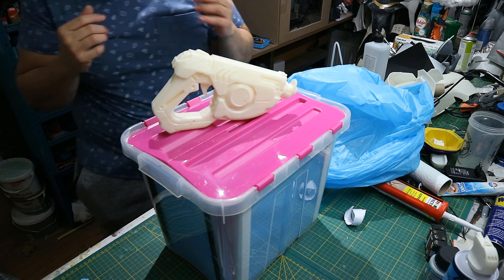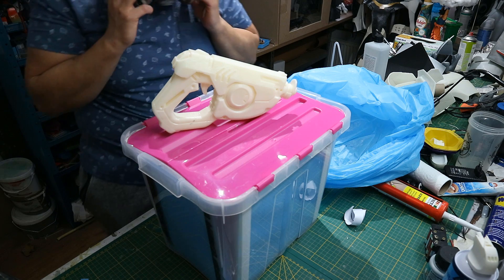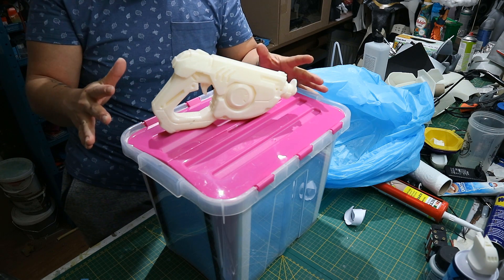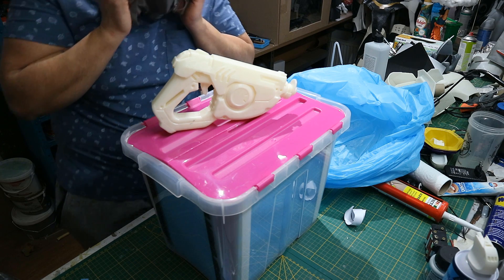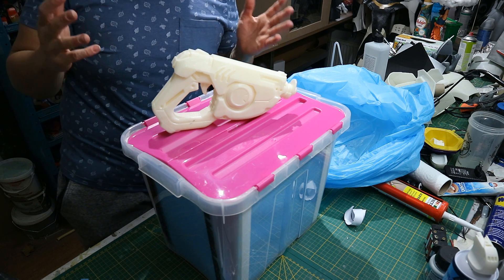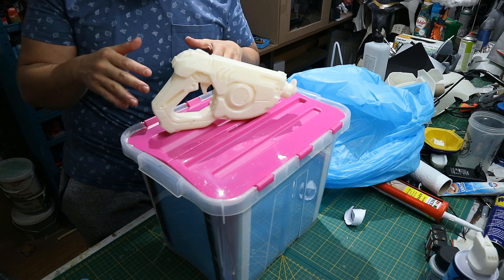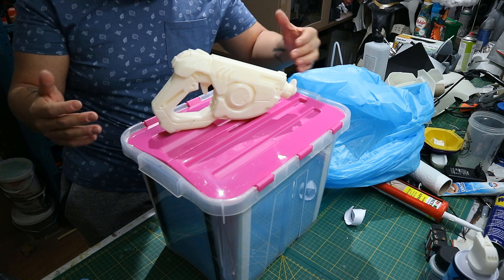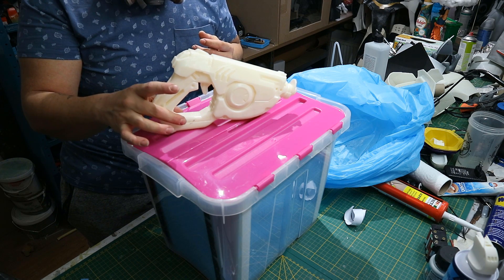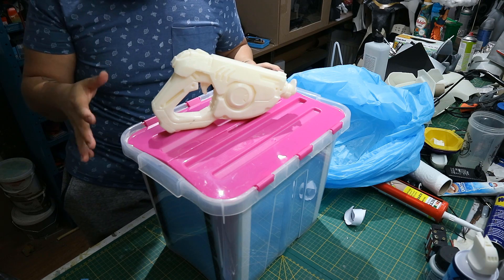It is actually quite sticky now because all of the ABS is kind of soft and smooth — the edges are melted. Once you take it out, the acetone is still doing its thing, so leave it for about an hour to fully harden back out. If you have a more dense model with higher infill, maybe go longer; a less dense model with lesser infill, do it shorter. This one is 10% infill so the internal supports are keeping the model together even though it's soft. If you press too hard you'd start seeing fingerprints in it.